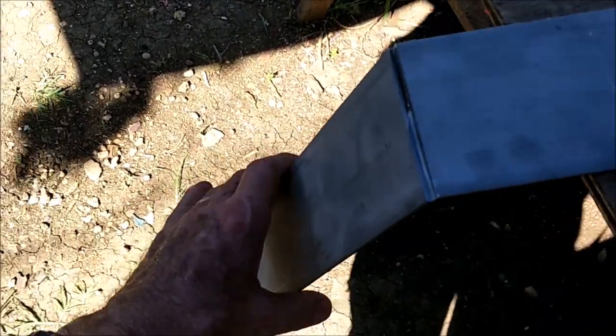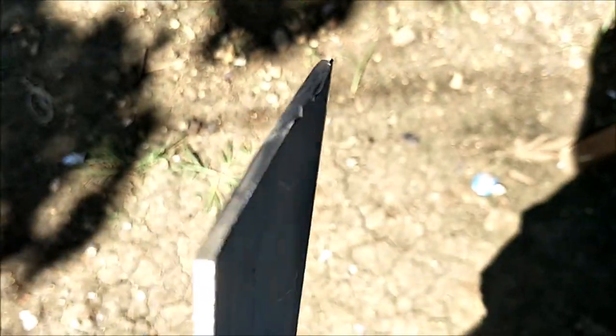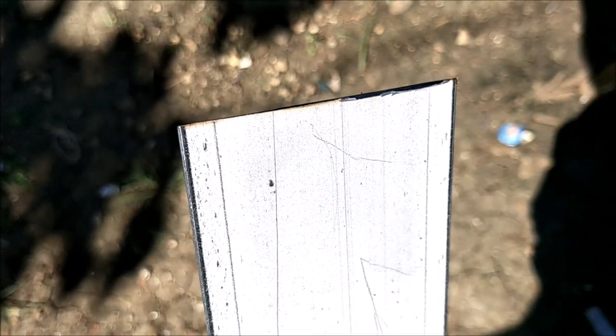As you can see, I cut it and cut it until it just fell down, then I bend it back and forth a few times and it comes off. Then I grind the edge because this little edge here is razor sharp — all that slag will just slice you. So I take the grinder and round all the edges off, corners too, just a light grind, and that all comes off so you don't have to worry about cutting yourself.